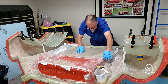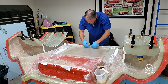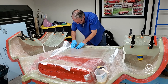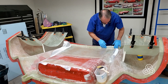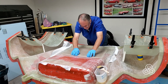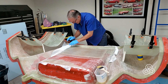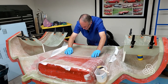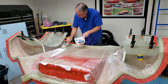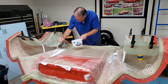We'll bond that Nomex into place with a top coat. I've created my own little prepreg — laid up four layers of fiberglass on a polyethylene sheet, part of an old trash bag — so I can squeegee it nice and flat on the workbench, then bring it over and lay it on top of the Nomex, smooth it out, and get all the air bubbles out. The top layer also has a little bit of dry cloth that we'll come back in and finish saturating. That cloth laps over and helps add a greater bond to the surfaces away from the Nomex.